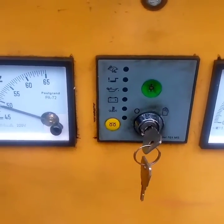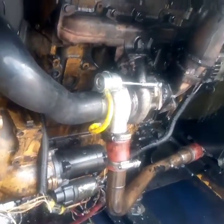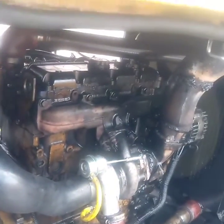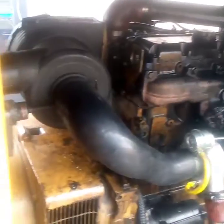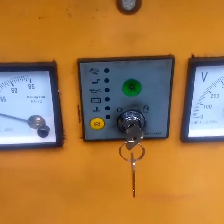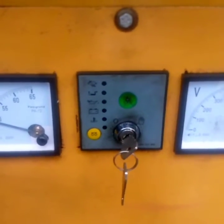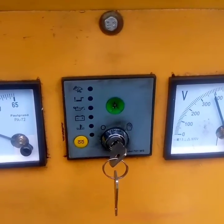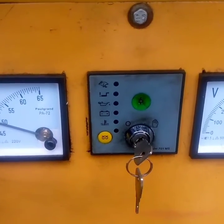The reason I allow it to be low is because I just finished assembling the engine and I don't want it to run on full speed — I want it to run at a moderate level first, then adjust it back to 50 and 400 respectively. To do that, I go to my injector pump and increase the injector pump speed. I lowered the injector pump speed so that the engine can run without load for now, then I'll later increase it to the normal setting. You can see here my Hz is below 50.